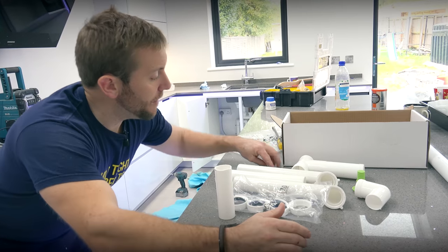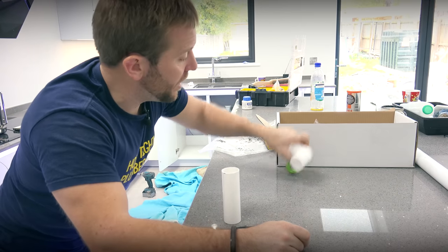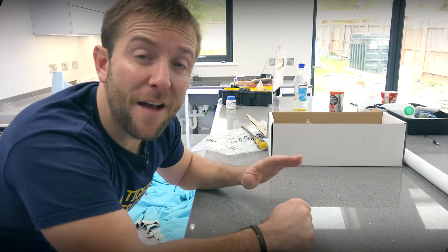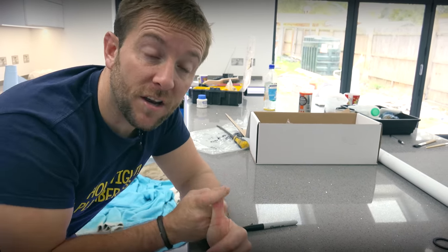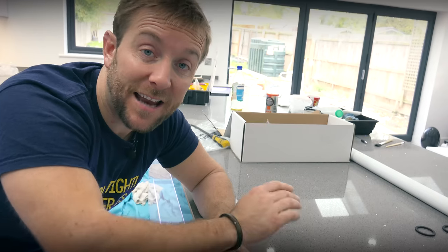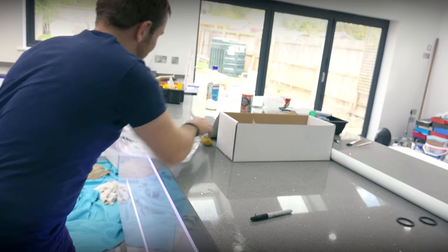Look at how much we've got left over - these are handy for us plumbers because they're great for pump valves. That's going back in the box, but this is just going to go in here just in case they want to add more stuff. That just shows you how much stuff is left over when you do a job like this. We've filled up, we've done a couple of flushes, everything's running away - absolutely hunky-dory, I'm really pleased. So remember: do the tops first, then build up your trap, then build up your manifold. Figure out what you want to go where, cut everything back so it fits nicely into your manifold, and then run your manifold outlet back to the stack and you're sorted. It's easy, but when you open up a box like that it fills a lot of people with terror - and I've got to say, even I open it now and go, oh good God, especially when you see instructions like that.